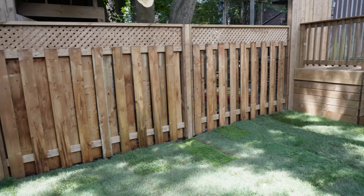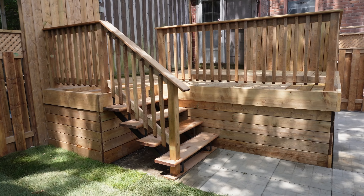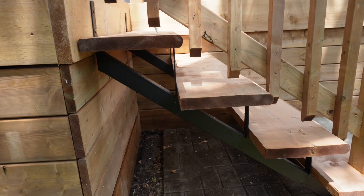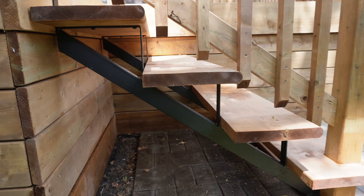Again, new fence all the way around. And here is the new deck. We went with simplistic wooden railings and pickets. We found these stair treads with rounded fronts and metal stringers. We like the pre-made metal stringers — I think they're stronger. And we ended up skirting the deck with deck boards. There'll be dogs and kids back here, so these are nice and strong.